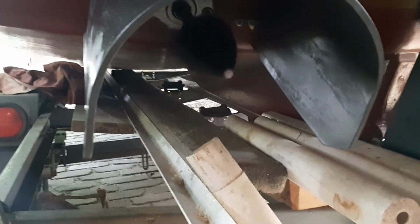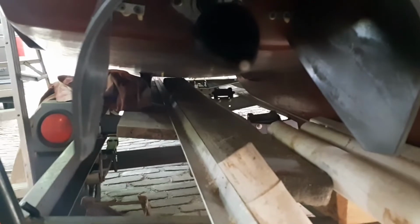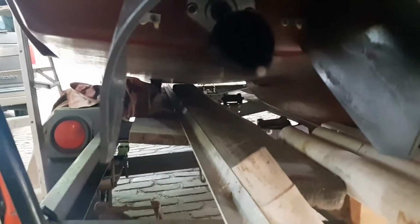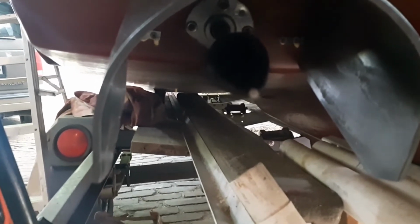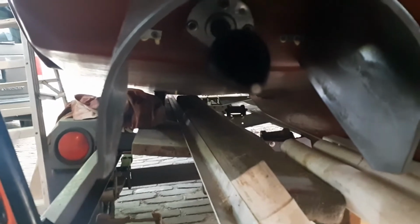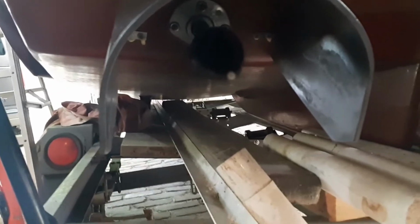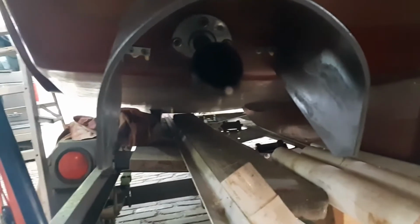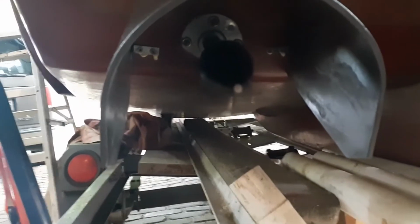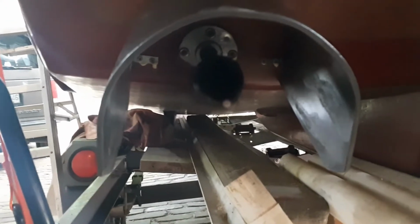So there you can look at the tip, and I don't know if it shows on video, but there's no wobble. But you've also noticed I pushed it back from the full extension, and I'll have to experiment on the water whether I get the same performance further back, because then there's less shaft sticking beyond and less prone to being bent around. So if I still get decent speed, it seems like 12 volts is the right answer at the moment. I'm not seeing anything heat up.